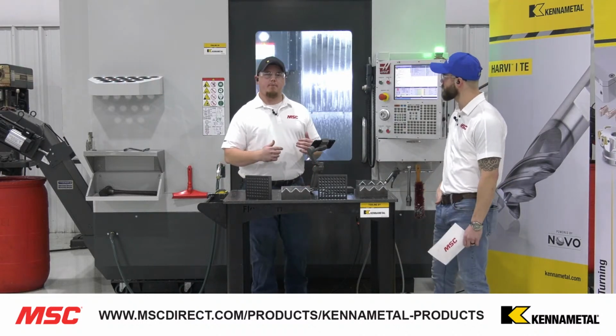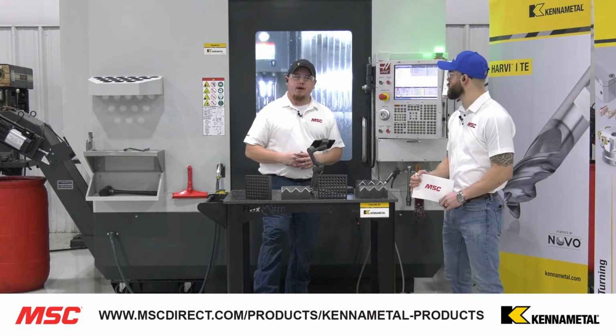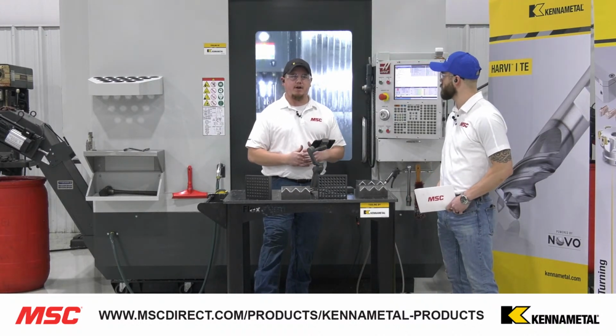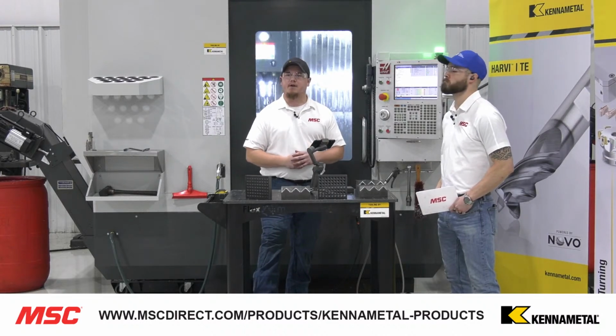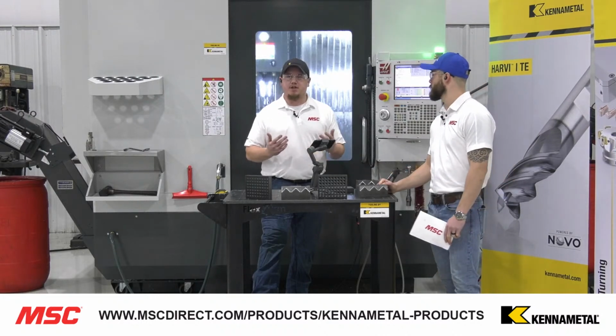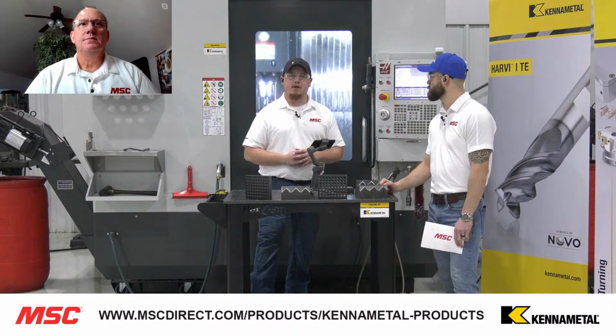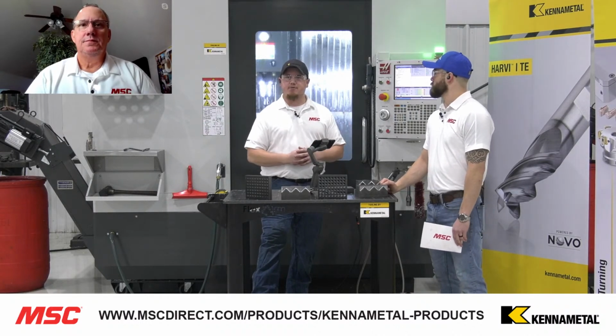Yeah, so next, as I mentioned before, we're going to get into some drilling. So I went ahead and changed out parts here. The first part that we're going to run here, we're going to showcase kind of the good and better options here. And we'll bring in Tony here. The first tool I'm going to run is just going to be a 1/2-inch high-speed steel drill. And then we're going to get into the Kennametal GOdrill. So I'm going to go ahead and get this thing rolling.